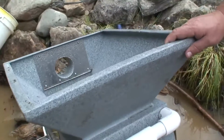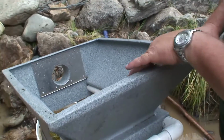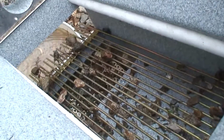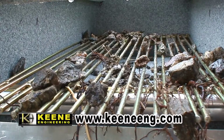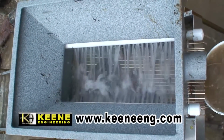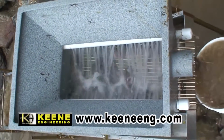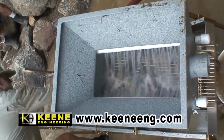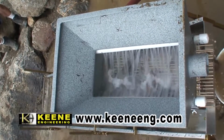The hopper is adjustable on the height, and it's also a little longer, with what are called Grizzly Screens inside here, than most normal high bankers. So if you're dealing with material that's got a lot of clay on it, the clay will stay on there, get rinsed, and then I can flatten out the classifier if I want to, so I can keep the clay in there for a longer time, so it has a chance for the water jets to spray and emulsify it.